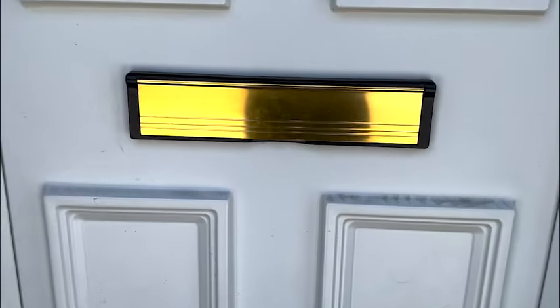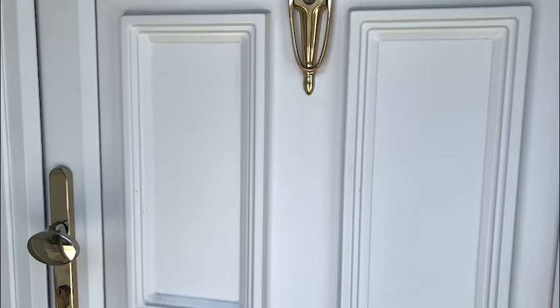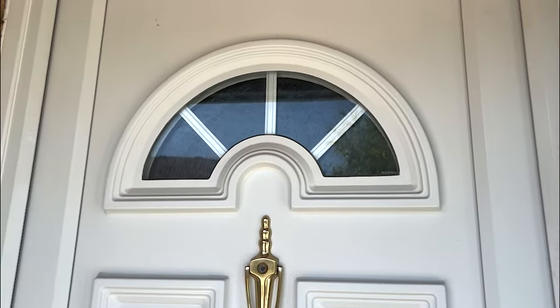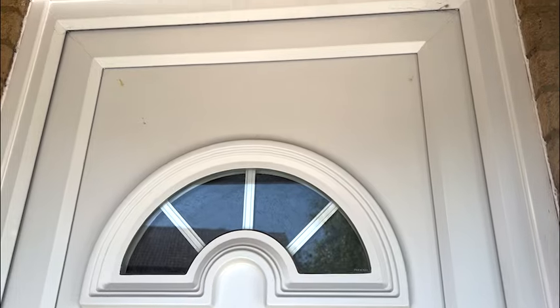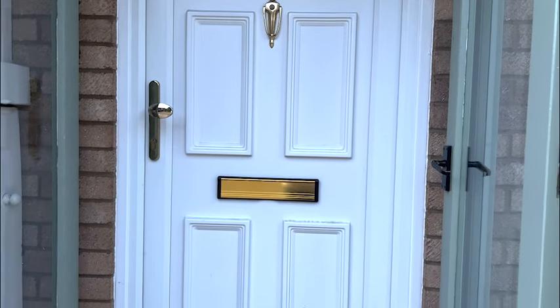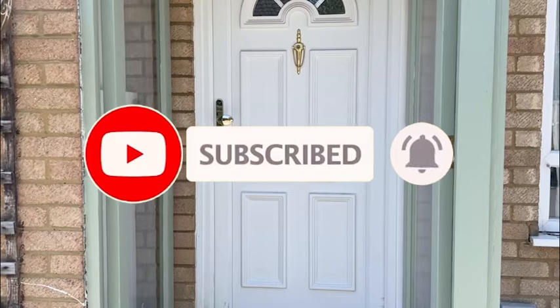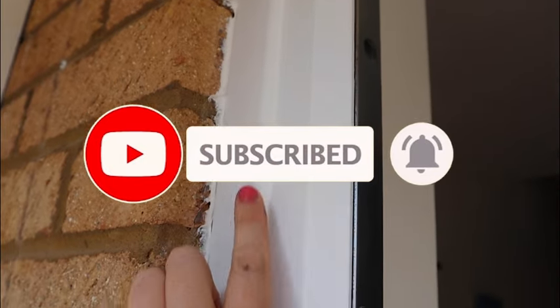So it'll be nice to give it a little bit more personality. The porch area needs a little bit of a makeover in general, and that will have to come at a later date, but for now we're going to focus on the main feature — the front door itself. Before painting you would normally sand something, but that is not going to go well with this plastic front door, so I'm going to use Slick Stick, which is a product for shiny or laminate surfaces — perfect for something like this.